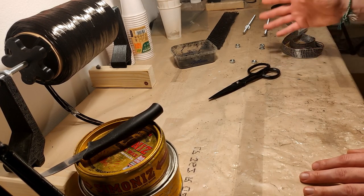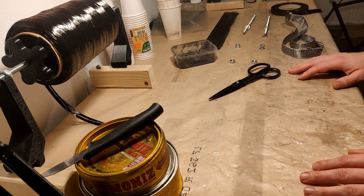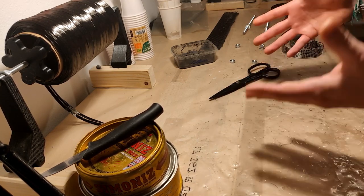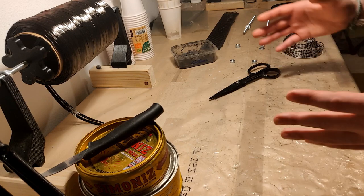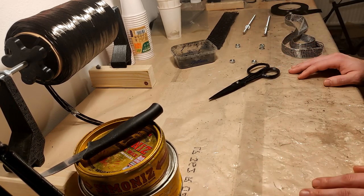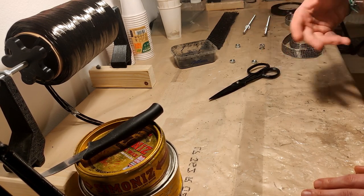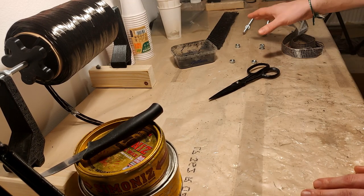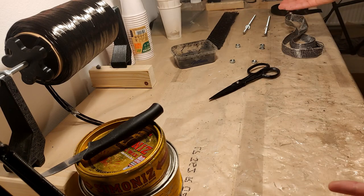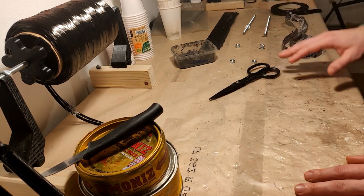Also to mention, epoxy curing is an exothermic reaction so it will heat up as it cures. If you have a volume sufficient enough or a part thick enough, it will actually heat up to a point where a plastic mold will distort or melt. I will be using infusion resin in this case, which is actually perfect for chopped fiber as it lets it flow into whatever shape. For continuous fiber I'd actually recommend something more viscous so the resin doesn't flow out of the fabric while you're laying it. All right, let me clean up here and we'll do some molding.